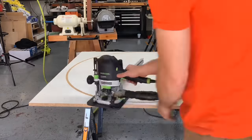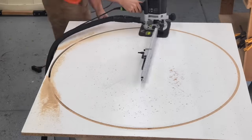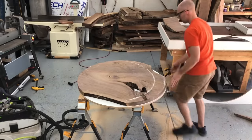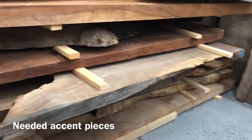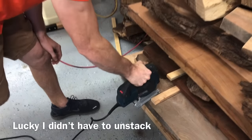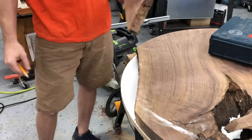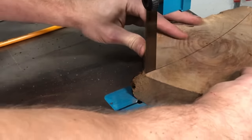I've made a few round tables so far and I finally feel like I'm pretty good at making these molds. What I do is make a slightly oversized mold from melamine, cutting it about an inch bigger than the final size of my table, and I use the same circle jig that I used to cut the table. Since I'll be cutting another perfect circle after the epoxy is poured, you don't need to be completely surgical about cutting on that line — you just want it to sit roughly inside the mold.